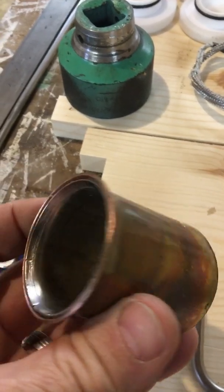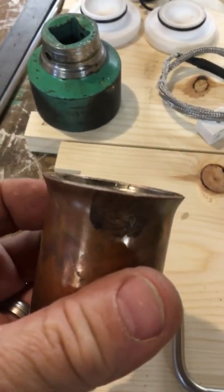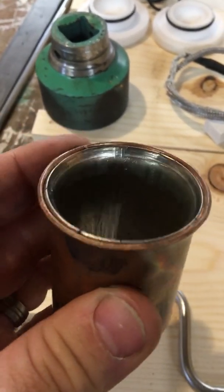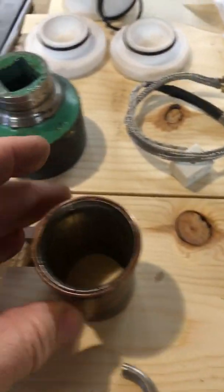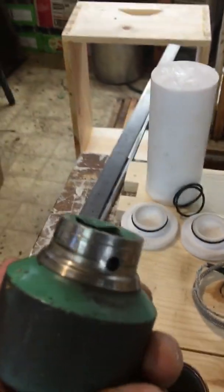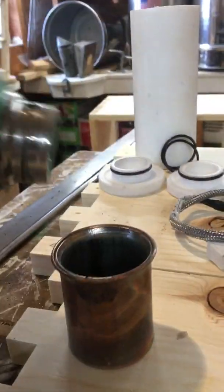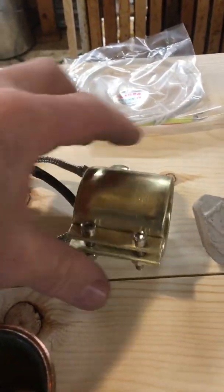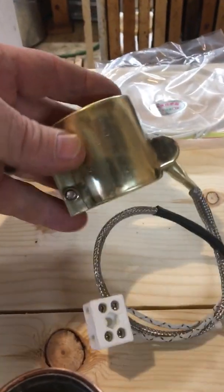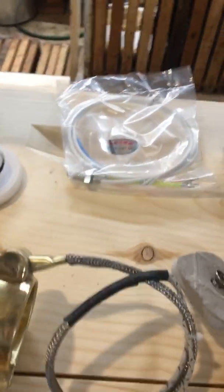The stainless steel tubing is pressed inside, then I put the copper sleeve on — all units have a copper sleeve. I pressed an el-cheapo socket, turned it down on the lathe a little bit, pressed it in to make the flare in the vise, which makes it nice. The band heaters are bought on Amazon — 110V/220V, takes either.